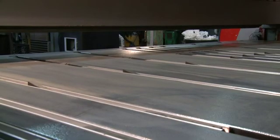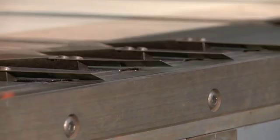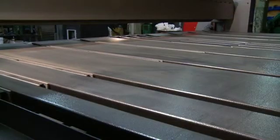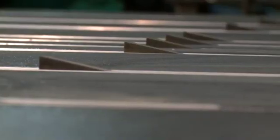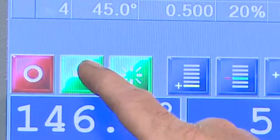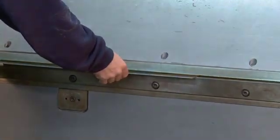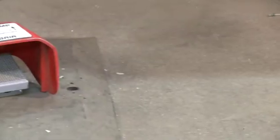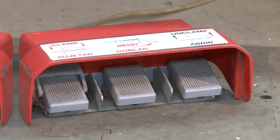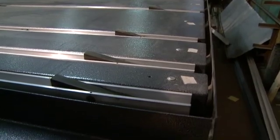The AutoBrake features three fingers: a spring finger which can virtually be brought to the front of the nose bar of the machine, and two sets of fixed fingers that will pop up according to the program. There is no need for a back gauge to run full stroke — 40 inches, or the optional 61-inch back gauge. Within a couple of seconds the dimension is reached and the machine is ready to load. On very large parts, or shops that require two men on a brake, an optional second foot pedal for the safety of both men may be ordered. By moving the control to the rear side of the machine, a second foot pedal can be put there for rear loading of very large parts.